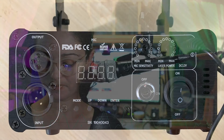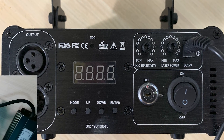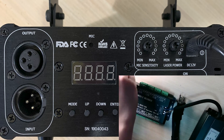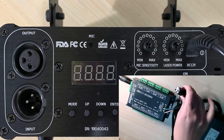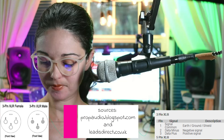On a standard DMX light fixture that uses XLR connectors, the male XLR connector is used as DMX in and the female XLR connector is used as DMX out. Wiring up my connectors to the decoder also requires figuring out which pin corresponds to which DMX conductor on the decoder.